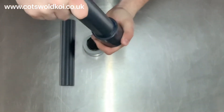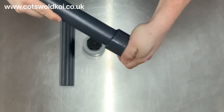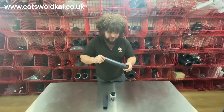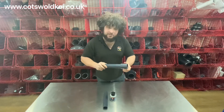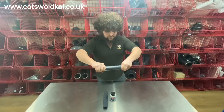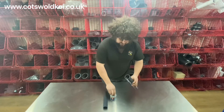The aim is to have a little bit of glue coming out but not loads oozing out everywhere. For people that are inexperienced, if it's underground and you're not going to see it, more is better — the last thing you want is a leak at the bottom underneath your pond. That's glued now, and even after a very short period of time I can't twist that off. Just do that again — it's just that simple.